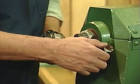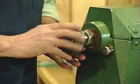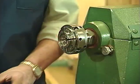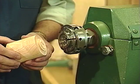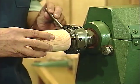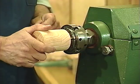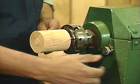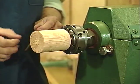The first thing that we do is to lock the headstock. We then wind the chuck onto the spindle. We have here prepared a block that has the spigot turned with a slight undercut. This then goes into the jaws and the lock ring goes down onto that tenon. This gives a very secure fixing. We release the pin and we're now ready to turn our box.